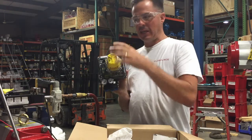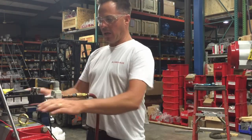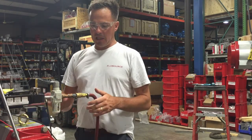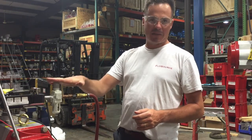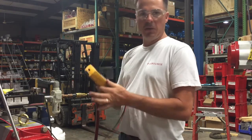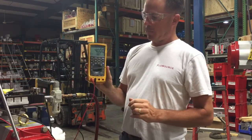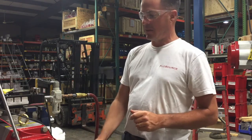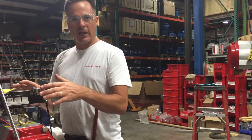So let's see how we set this up. To start with, we've mounted the positioner on a spring return actuator. We've piped up 80 PSI of air into our regulator that happens to come with this unit. We've hooked up our loop generator and we're going to turn this on. We're going to set this at 12 milliamps, and from here we're going to start the calibration process.